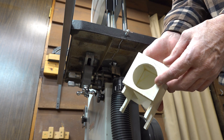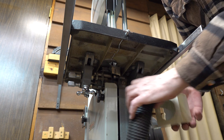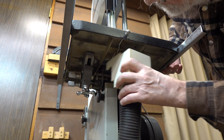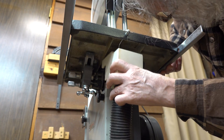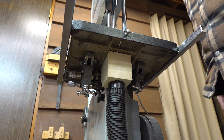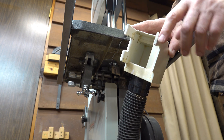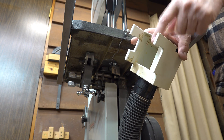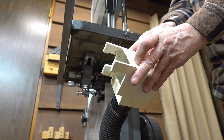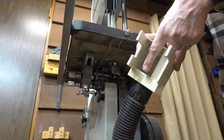Now this part — there's no reason you need to make it out of quarter inch styrene, although you could if you wanted to. I would suggest making this out of something easier, like quarter inch plywood. But this goes in something like this and stays in on its own. The thing you need to be concerned with is that you have some ears, some sides that go past where the blade is. The blade is where this hole is, right up against this wall. So the blade is encompassed by the vacuum.